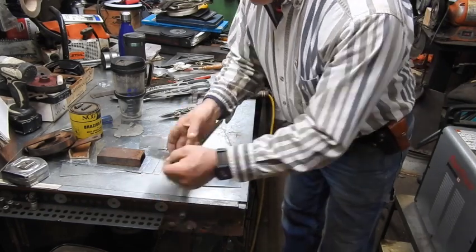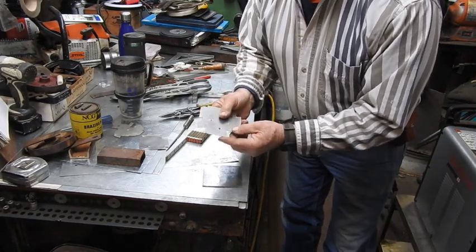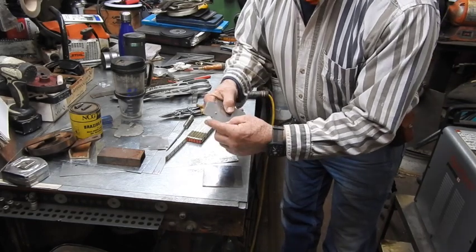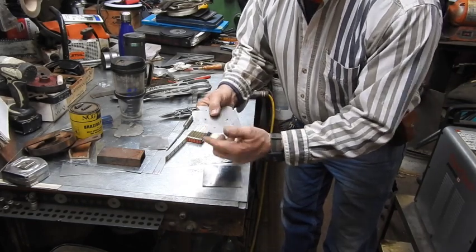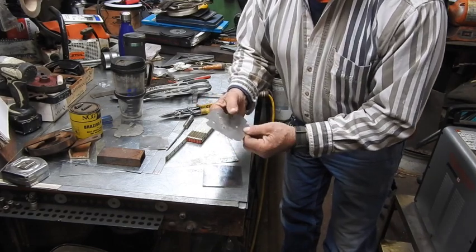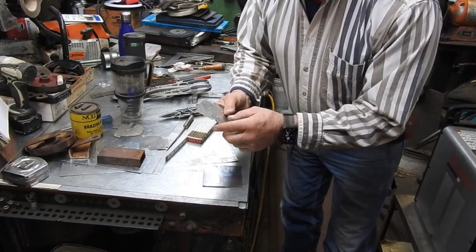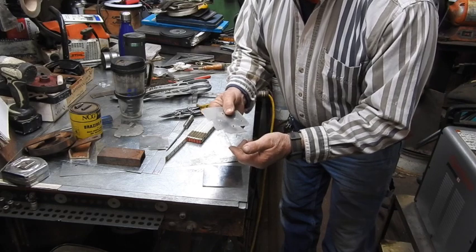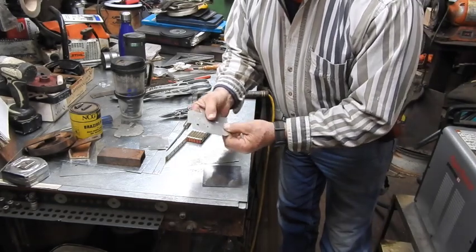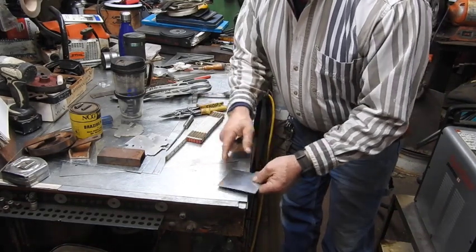The reason I do that is because the majority of what you're going to use is the 1/4, the 1/2, and the 1 inch for your Pittsburgh, for your 1/2 inch double hem flange, and also your 1/4 inch for the other side of the Pittsburgh. I got a 3/8 notch cut into the side because sometimes you use the 3/8, but not very often. The 3/4 is the least used, so I put that in the out of the way location. But it's the 1/4, 1/2, and 1 inch. So that's what we have here.